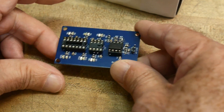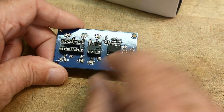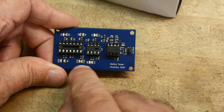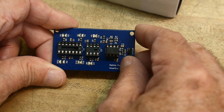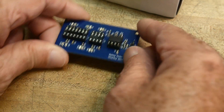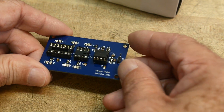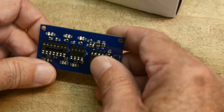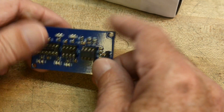So I used the technique of using an IR reflow oven. I put the solder paste with a hypodermic everywhere, then loaded all of the parts by hand with tweezers, and then put it in the oven and it baked them all in and melted the solder. And then I had to add the through-hole components by hand afterwards.